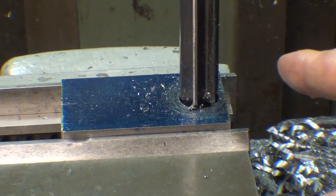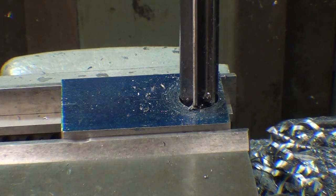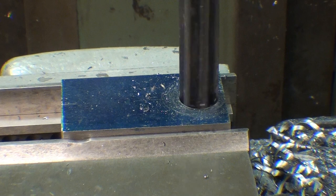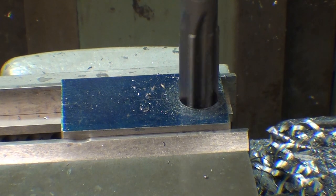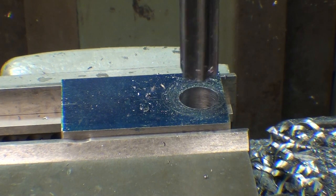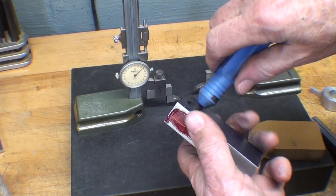And now the three-quarter reamer. Never run a reamer backwards. Always run them at slow speed and do not try to remove too much with them. I'm taking off only a 1/64. Go through far enough to where you overcome the tapered portion of the reamer. Noga deburring tool.